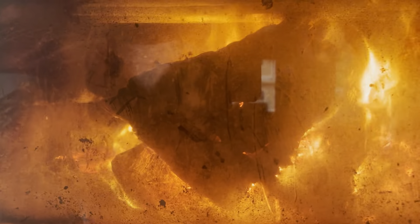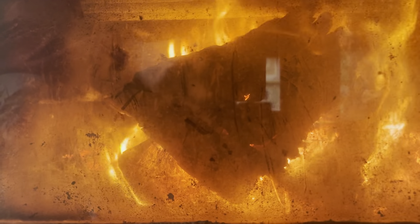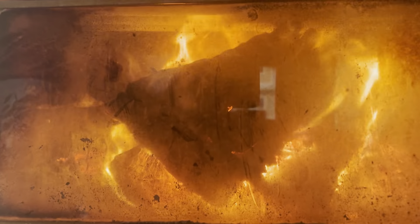For ongoing maintenance, once you are certain that your flue or chimney is clean, introduce these three methods: burning it very hot in the morning and evening, using this creosote remover, and sweeping your chimney. These should be sufficient methods to help ensure that your chimney will not catch on fire. Hopefully this was helpful — I appreciate your time and hope everyone has a wonderful day.